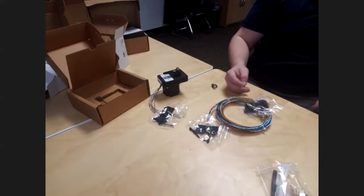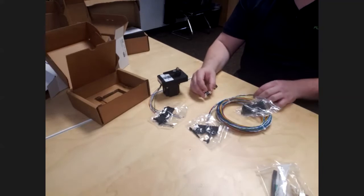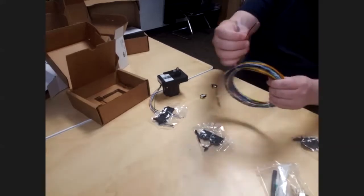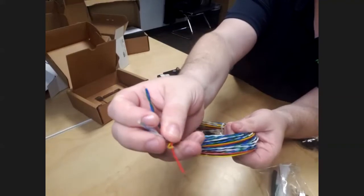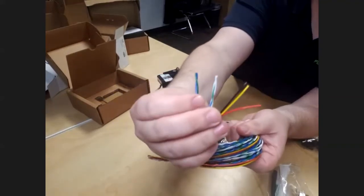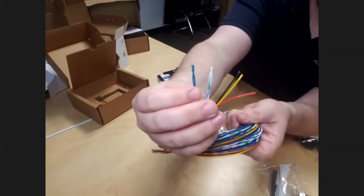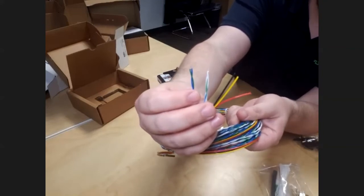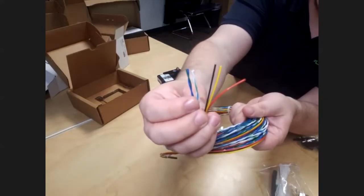So the servo wiring harness actually has, although I think it's six or seven of the wires going into SkyView network, power and ground getting picked off and need to go to ship's power directly because you actually need a substantial amount of power. So that's all well documented, and just the way the harness is built, it's hard to mess up. But just worth noting that the servos do have separate power and ground wires for actually providing the power into the servo from ship. So these twisted pairs are your redundant data streams, A and B.